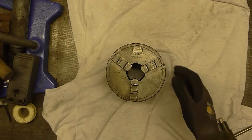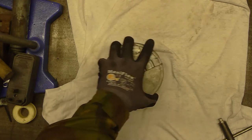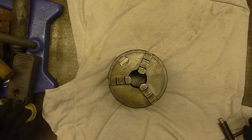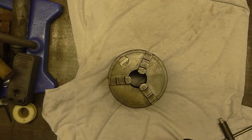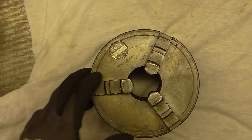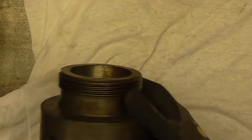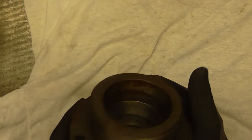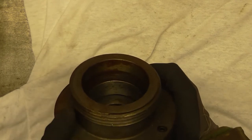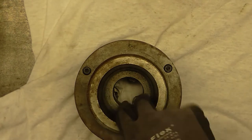What I've got here is the Pratt chuck that came with my Harrison L5 — it's got an integral L00 mounting. My lathe was an ex-schools lathe, and you can see there are quite a few battle scars on this thing. The jaws are belled, they've got a little bit of rock in them, and there's a little bit of surface rust in here. Down in there you can see a lot of dings in the taper where people were not good about clearing this thing out before mounting.